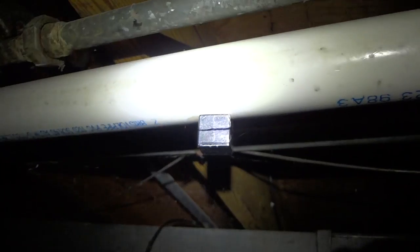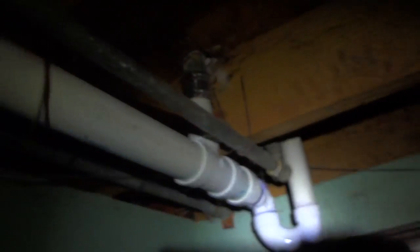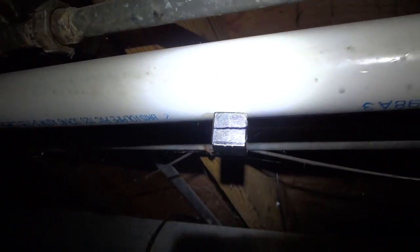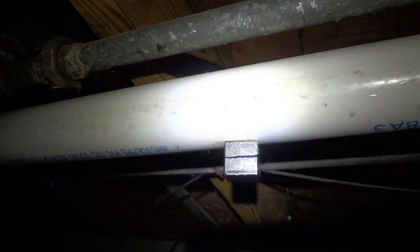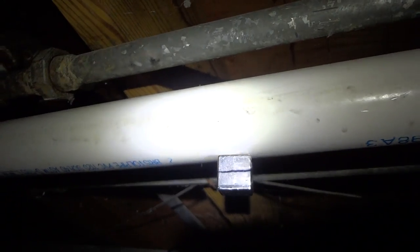My drains are already clear so I'm just showing you how they clear. To get this out of the way, I could extract the magnet the same way it came in, but I actually have a section where I can drag this magnet up to the top and drop the smaller magnet with the scrubber off a section of pipe that doesn't impede flow. The inside magnet is half an inch by quarter inch, and the scrubby brings the total diameter to just a hair over half an inch.